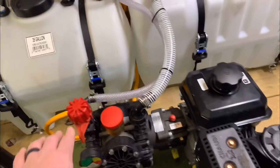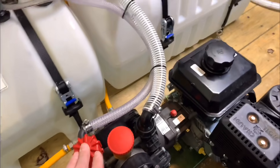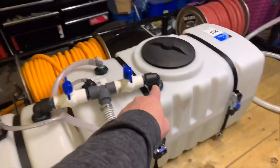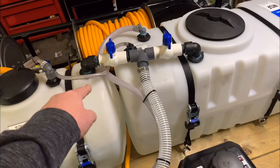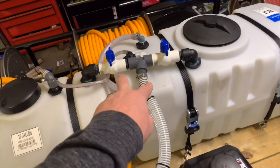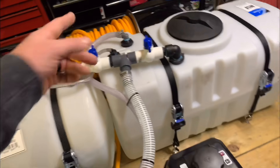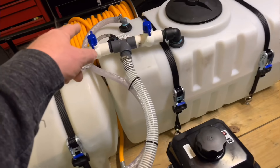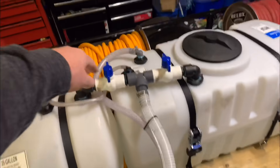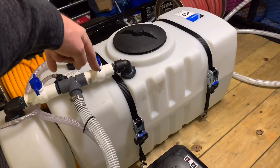On my chemical pump over here — I'll start with the intake. I put one tube in the chemical tank and one tube in the water tank, and then I have two ball valves. This way we can turn off the soap and turn on the water so we can clean that pump out. That's the only time we're really going to want to turn that water on — if we leave it running, it's going to fill up our soap tank.